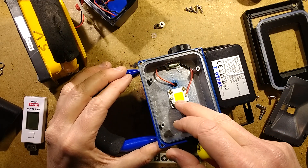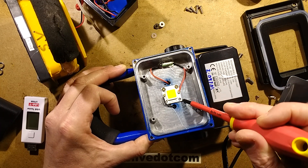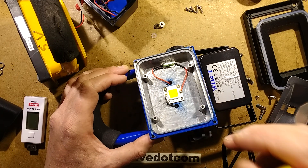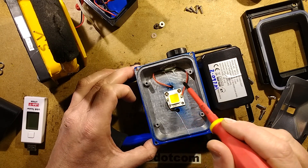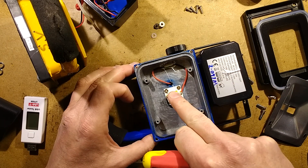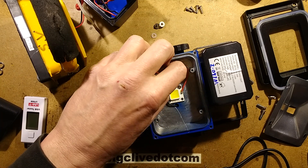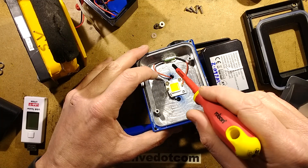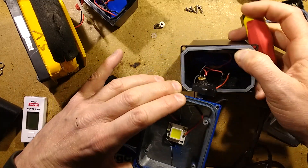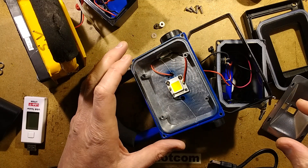It's not even a standard chip — it's just a COB with a little dam around it on a circuit board, and two sheared screws by the look of it. I think they've had a bad time putting this together. And there's a 1.2 ohm resistor — that's what's limiting the current. This does offer the opportunity that if you wanted to change this to run for a longer time at lower power, you can change that resistor value, or you could stuff the back absolutely full of batteries. Lots of options for hacking these — they're worth it just for the case alone.